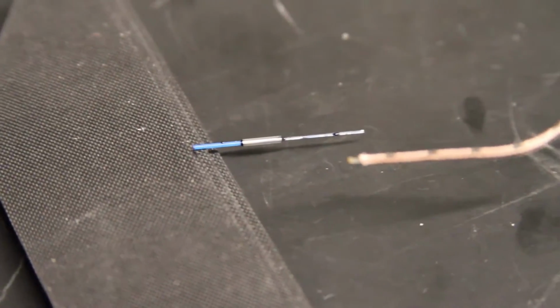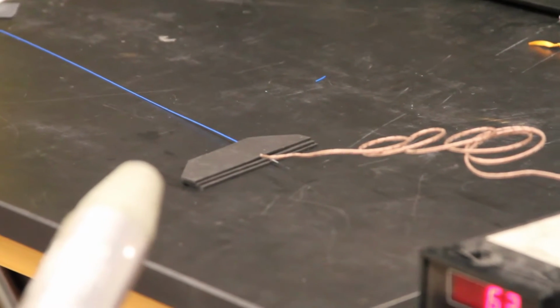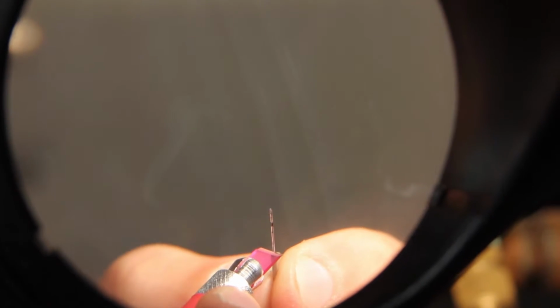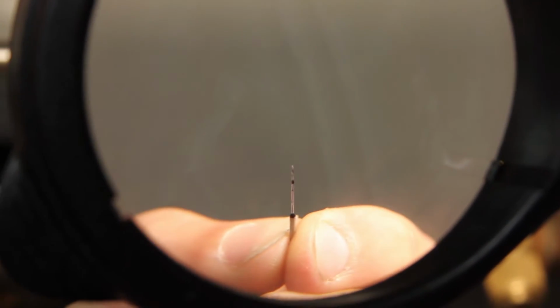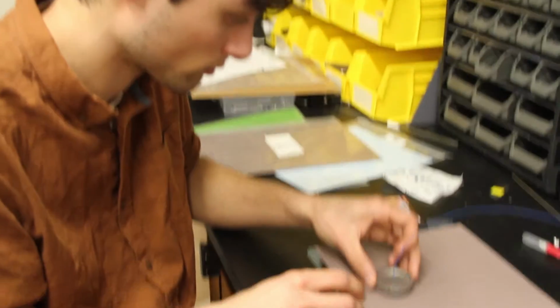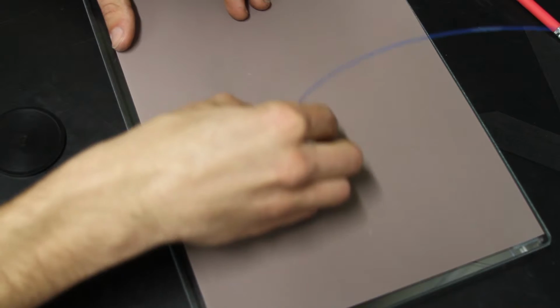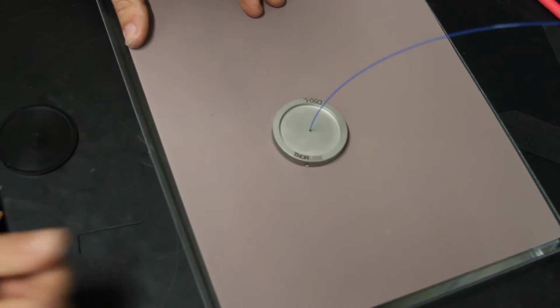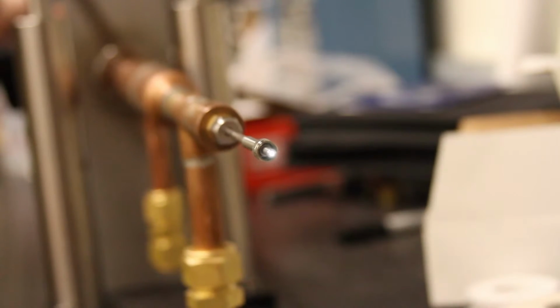Initially, we had difficulties integrating the fiber optics into the probe. In order to terminate a fiber optic so that it can connect with other fiber optic cables, there's a complex process required that involves using epoxy, a fiber cutter, and polishing tools. After painstakingly trimming and polishing the fiber we had purchased, we found that it did not transmit any light. In the end, we had to purchase another thicker cable and restart the whole process, as well as order new polishing materials. Thankfully, with the thicker optical fiber, light was transmitted through the probe, as we hoped it would.